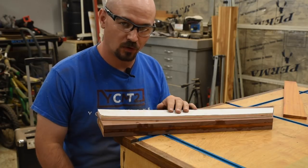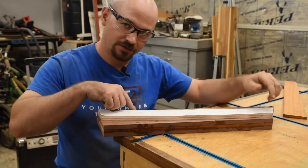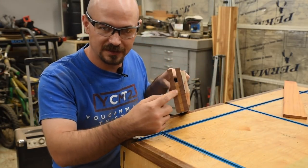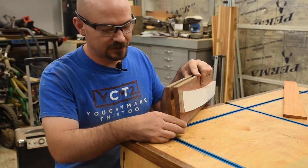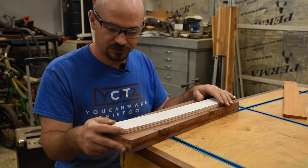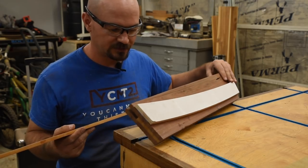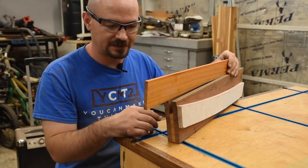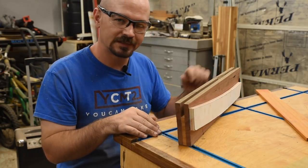I've made a horrible, avoidable mistake. I followed the chalk lines but I didn't think to verify the orange heart, because the orange heart was smaller than these pieces. As I said, that was very preventable — after I glued up the orange heart, I should have cut the walnut to close to size, redrawn, or just checked. There were several failures here. But the fix, since this is just for me and it's a piece of spec work, is I have an offcut — I'm just going to get some glue, shove that down there, throw a clamp on it, let it sit. Because the end grain isn't going to show, it'll be barely noticeable.